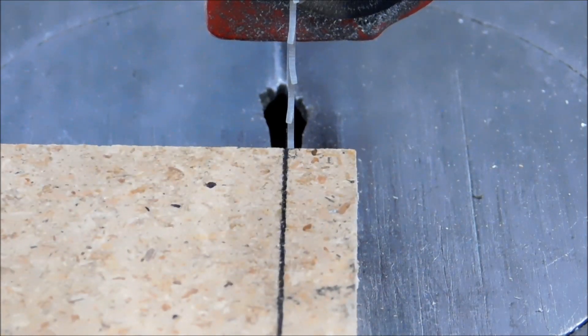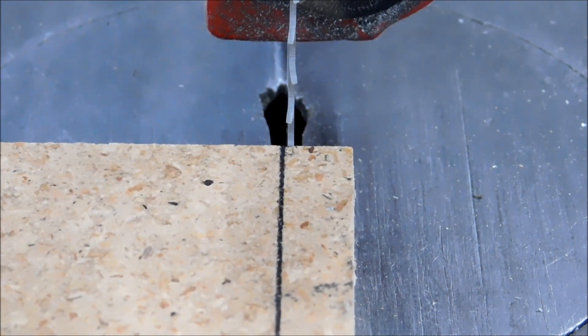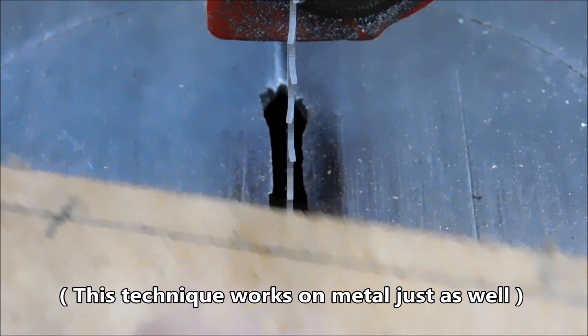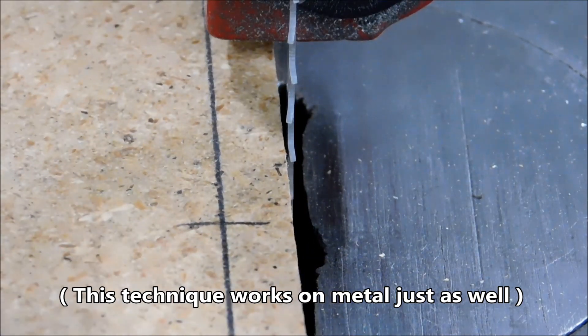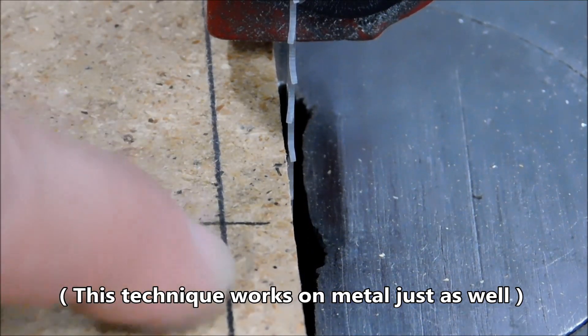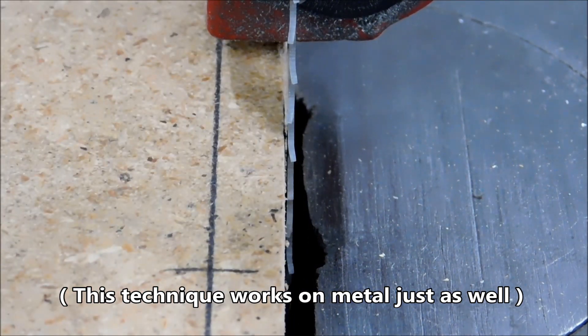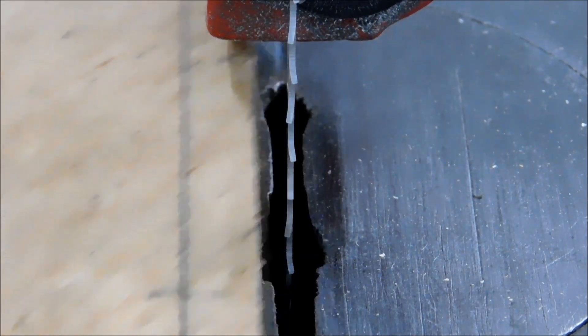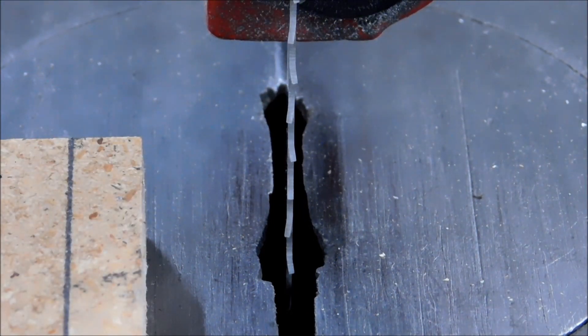For sake of demonstration, I am going to attempt to saw this chunk of wood without removing that pencil line right there. But halfway down I've got two marks — I'm going to jump off the line, move to the outside, and then come back and continue. Now the ride-the-blade technique: I'm going to go back in a second cut and remove the high spot, hopefully with the same integrity that the initial cut was made with. The camera is directly between my eyes and this blade, so bear with me and I hope this goes well.